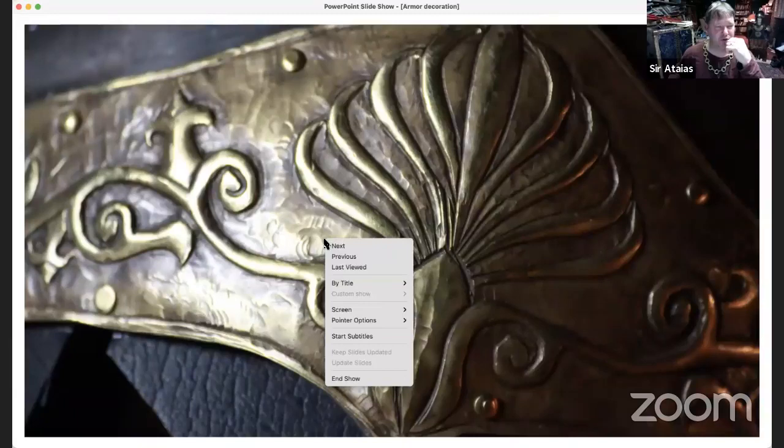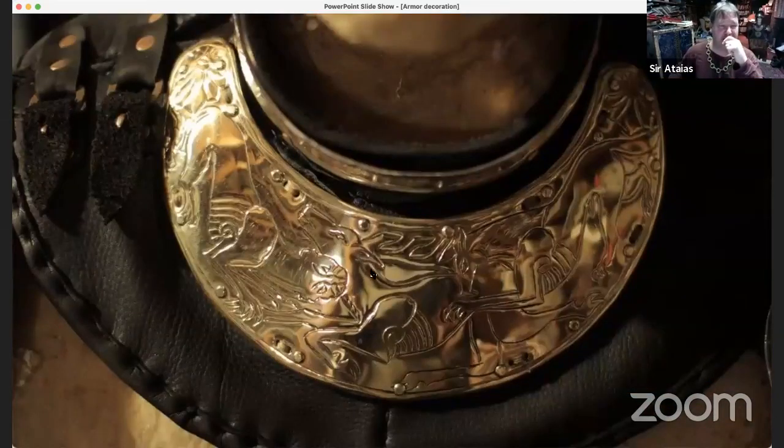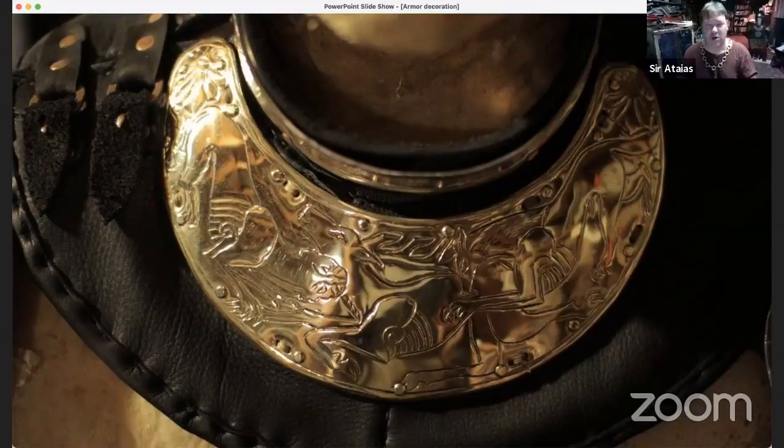Chasing is basically taking a metal tool and graving or impressing a thing into the surface. This is like me taking a lining tool, which looks like a chisel with a very shiny little end on it, so that it's an edge, but it's not too sharp where it actually cuts into the metal. What you're trying to do is press into the metal with indentations. And this is me using a little chisel tool to do a bunch of lines all over it. We're just making line drawings. You're just working it from one side for the most part, and just making lines in it.